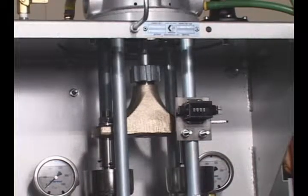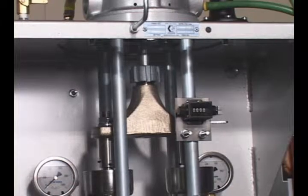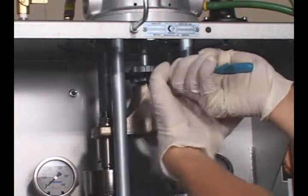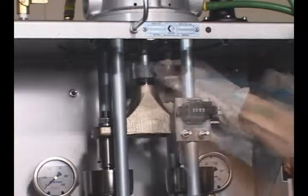The yoke must be in the lower position of the stroke cycle. Open the manifold hand valve or dispensing valve first. Use a tire tool or a crowbar to position the yoke. Remove the connecting rod yoke with channel lock pliers.